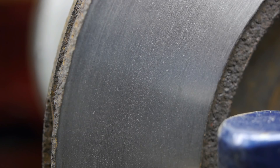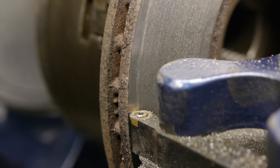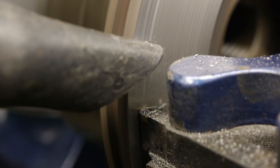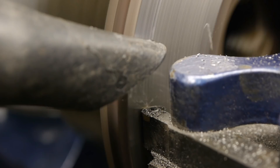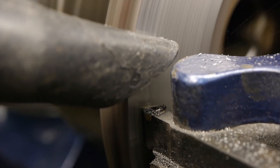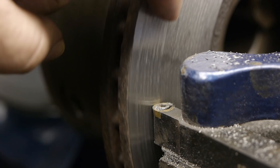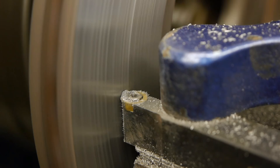See if I can improve the surface finish a little bit more. I accidentally dialed in too big of a cut and then the chatter issue becomes a real problem — the whole bench is rumbling. I'm running 170 rpm. Obviously the surface finish is pretty much shite — it's very wavy. I think the insert is losing its edge.